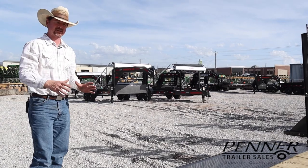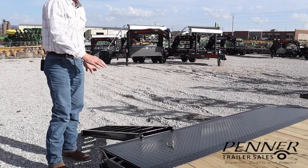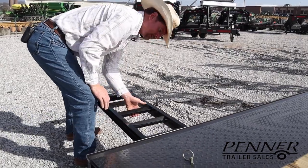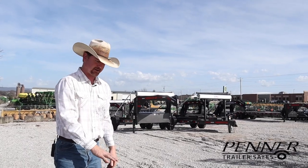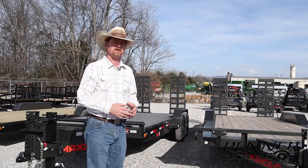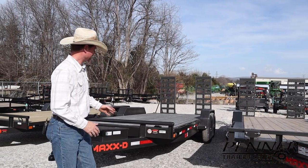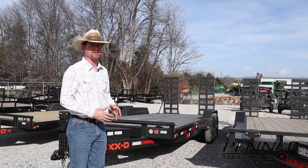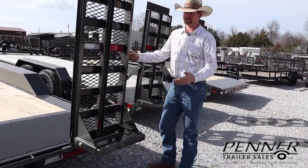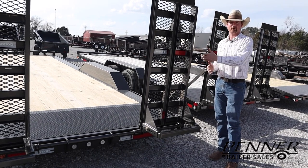Because this trailer is packaged on the lighter-duty range, we just have pull-out ramps in the back. Rear slide is definitely the most convenient because you don't have to carry it as much to stow it. Also, because of the nature of slide-in ramps for weight support, this trailer is optioned with stabilizer jacks that can be affixed to the rear. Moving up now to a medium-duty trailer — this trailer is optioned with a 6-inch C-channel frame as opposed to the 5-inch. It still has the wrapped tongue. It has 7,000-pound slipper spring axles. Moving to the back of the trailer, we see it also has the 2-foot dovetail and the equipment stand-up ramp with knee braces to accommodate heavier pieces of equipment being driven up.